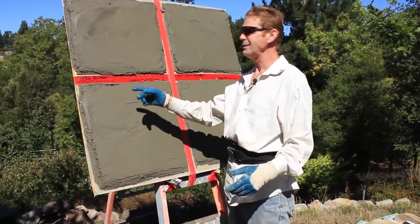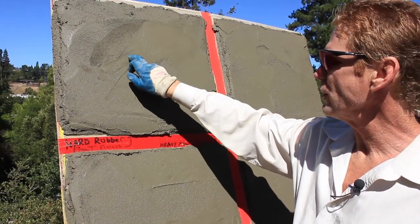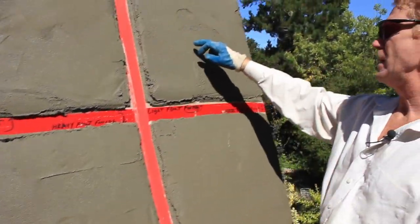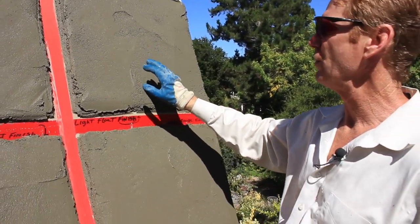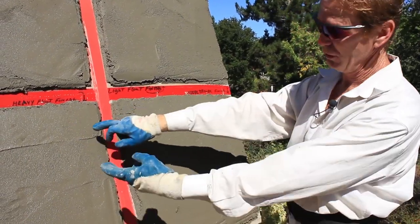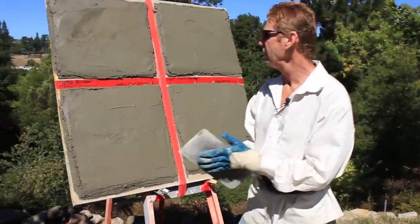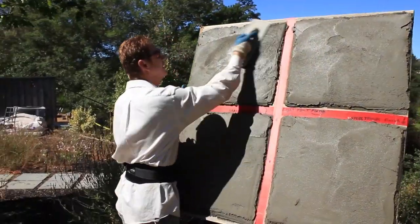Dan walked by earlier and said, Dad, I can't even make out what that is - how are people on the camera going to do it? There's a hard rubber float, what I'm going to show you up here - hard rubber float finish. Down here is going to be a heavy float finish; heavy just means a lot of water. Up here is a light float finish - a little bit of water, so it comes out a lot smoother, the grain is going to be very fine. This is going to be very heavy because I'm going to use a lot of water. Over here is just going to be a steel trowel finish.